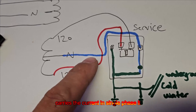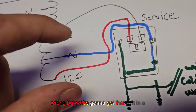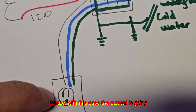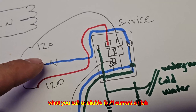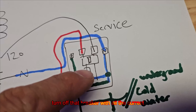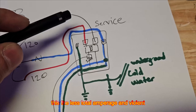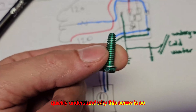The neutral carries the same amount of current as the hot in single phase. I drew a quick 20 amp circuit here going to a plug. In the event that the hot makes contact with the case, the current is going to get on the ground wire, make its way back to the neutral, go through the windings of the transformer generating available fault current — which is very high — then go through the main breaker, back to the source, and trip that breaker with all the current generated through the process of clearing the fault. We're going to clear this fault in about seven cycles, and there are 60 cycles in a second. The faster we can do this, the less total amperage and violent reactivity we get. Let's look at what happens when we have a sub panel — and you'll quickly understand why this screw is so damn dangerous.